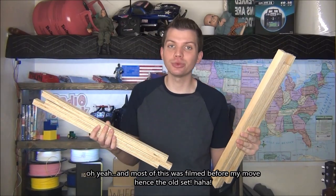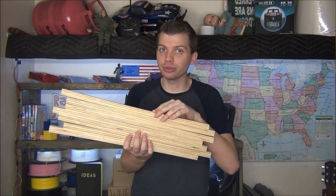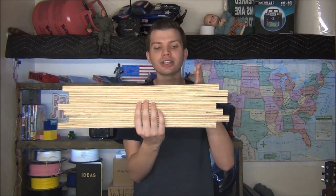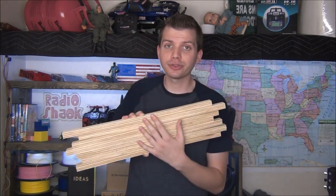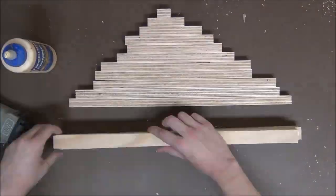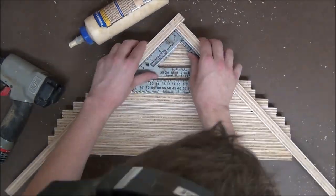Now with a bunch of these cut out, we're going to want to start gluing and nailing them together, grain facing outwards, in a triangular shape. We could glue these into a rectangle shape and then cut our right triangle out of the center, but in order to save material I like to cut the wood down beforehand. We're still going to have to cut the right triangle out after this, but this way we'll use a lot fewer boards and end up with a lot less waste. All I'm really doing is cutting a few boards in half at different points, arranging them smallest to largest, and gluing and nailing them together into our triangle shape.